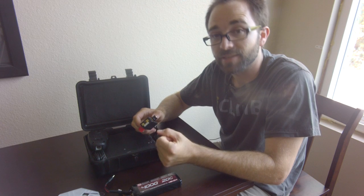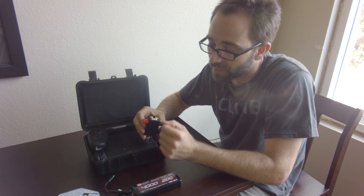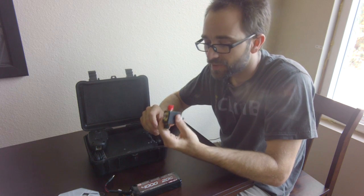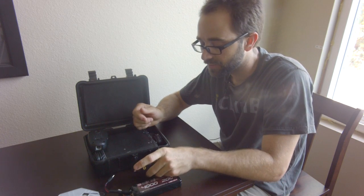and if I add the extension to make it an 80 meter dipole, it's nearly center fed, and the impedance is closer to 50 ohms, so the 1-to-1 balun works better with that. So that switch lets me easily switch back and forth and use this balun for all the applications.